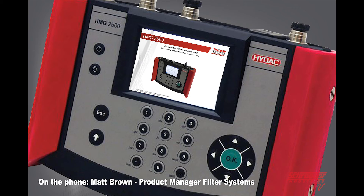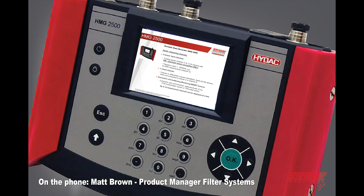The HMG 2500 is the budget unit. It has less functions than the 3010. It has four sensor input channels for three analog inputs, and you can only use the HSI automatic sensors on this unit — you cannot program a 4-20 milliamp non-HSI sensor on it. Whereas on our 3010 we could plug into someone else's sensor and it would scale it, you cannot do that on this one. There will be no touchscreen; it will use the same scroll pad directory as before. There is one virtual channel, which is channel E, and sensors have to be connected to channels A and B — so you could develop horsepower by tapping in a pressure and a flow gauge to A and B. But you can connect up to a smart sensor.